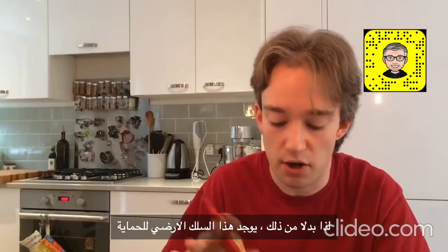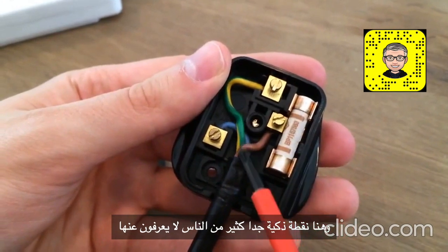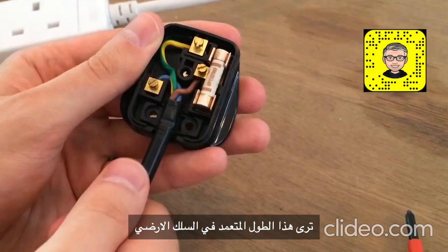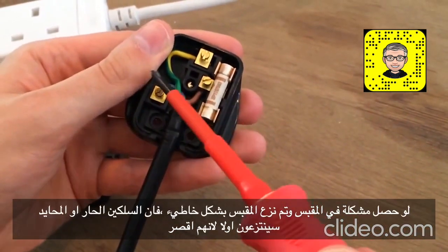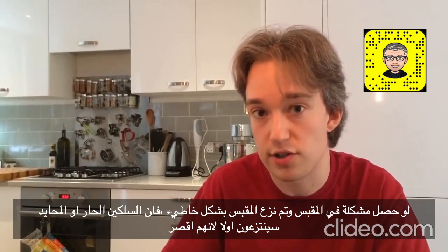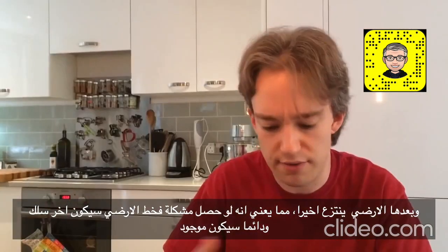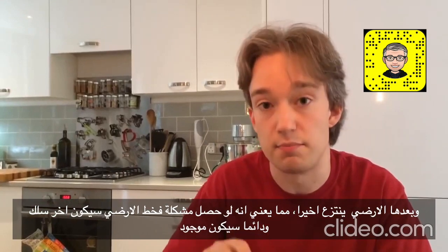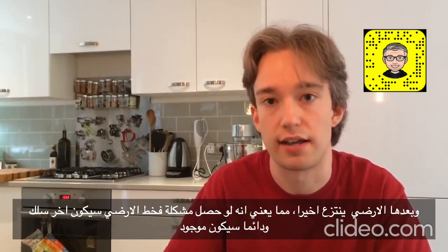So instead, you have this wire here. And this is the really clever bit — the bit that not many people know about. You see that slack in the wire just here? In the event there's a tug on this cable, something goes wrong, and all these start fraying and coming out, the live and the neutral — the ones where the danger is — they'll get pulled out first. And then the earth wire will come out next. So in the event of damage or fraying, it's most likely that the earth wire is going to be the last safe one, and no one's going to get killed.